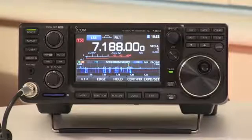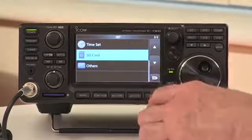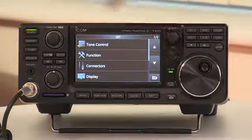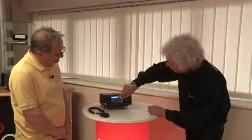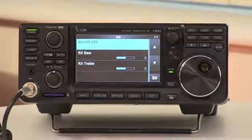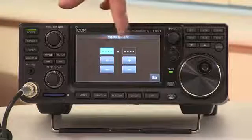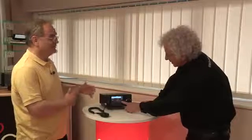What can we do to control and tailor our receive and transmit audio? It works fine out of the box — it's adjusted pretty well to suit most people. But you've got a set of items here for things you might want to set occasionally. Right at the top you've got tone control — you can alter the tone on both transmit and receive, and you can tailor it on each mode. So in sideband you've got treble or bass boost, or you can reduce it. You can actually alter the bandwidth too — rather than boost, you can define the upper and lower limits. Really it doesn't need much changing, and it's a very simple straightforward way of doing it, because this can get overcomplicated and people have got themselves very bogged down trying to sort out audio settings.